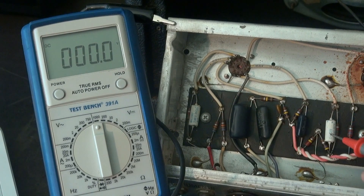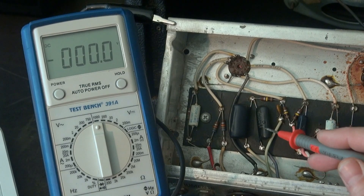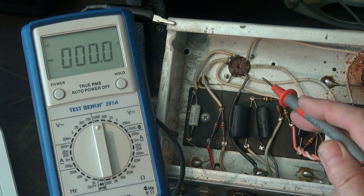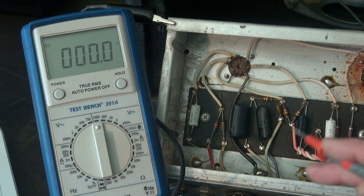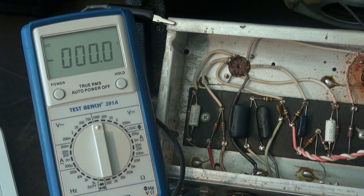That's why it's very important to give these things a really good visual inspection before you get in here and do any work. Because usually, if something is smoked, you're going to see evidence of it. Pretty much we know that the 12AX7 is operating, and so is the 6V6. Voltages in here look decent. They're not going to actually match that schematic, but you'll be able to tell if something is totally missing or totally whacked out in comparison to the schematic.